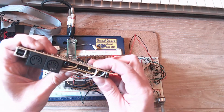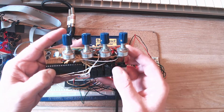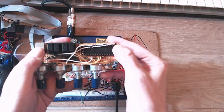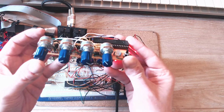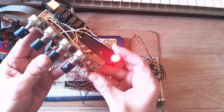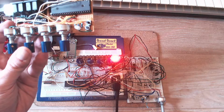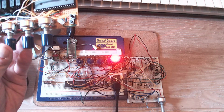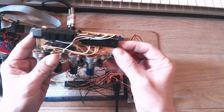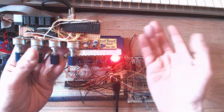Turned out it sounded rough, and that was because I'd started off using a system, supposedly for simplicity's sake, of having the IC, the microcontroller, generate the waveform digitally. That led me down a rabbit hole or a garden path of trying to get a good digital waveform, which is a lot more complicated than you think it is. And I ended up in a minefield of things like bandwidth limited impulse trains and whatever, because of the problems with aliasing, which is when the digital signal is creating false overtones which sound awful.